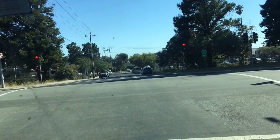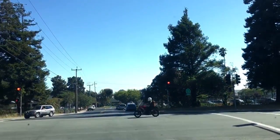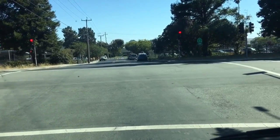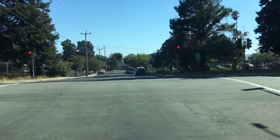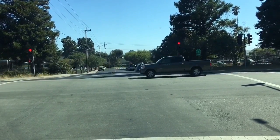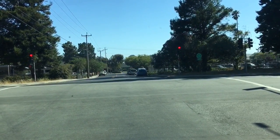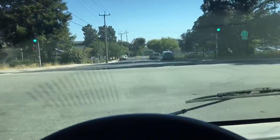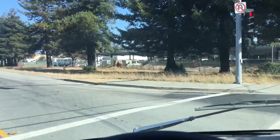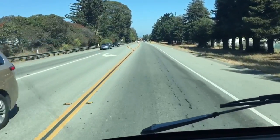Heading out to go change the fan cycle switch on an ice machine. It's been busy today. My AC's on. It's like 4:13 in the afternoon, it's kind of warm today. I've got to head out to Kim's mom's house tomorrow and fix her air conditioner. She's out in Clear Lake, California — I'll show you that on a map later. I think it's a 4 hour and 20 minute drive. It looks like either the capacitor for the condenser fan motor failed, or the condenser fan motor failed. I think I'll go through their system with the MeasureQuick app. So stay tuned for that. Let's go get into this little Manitowoc.